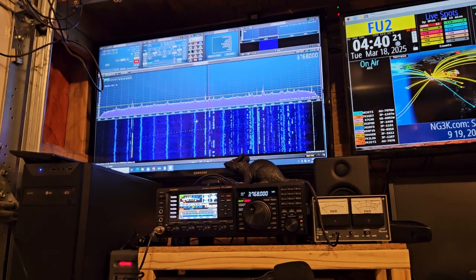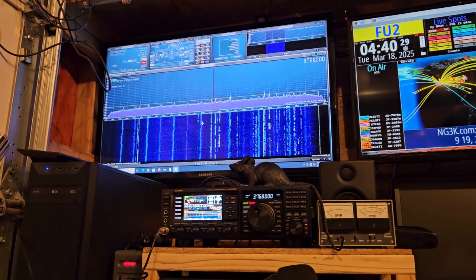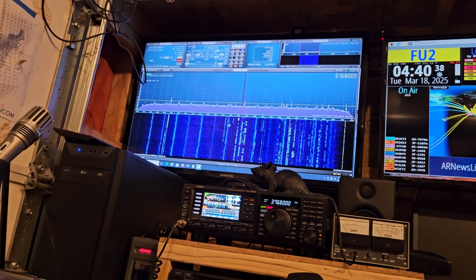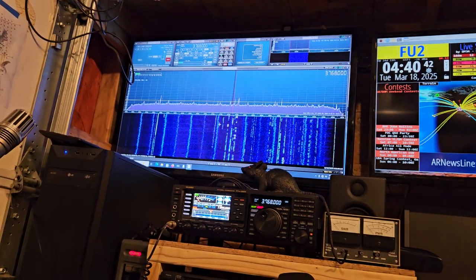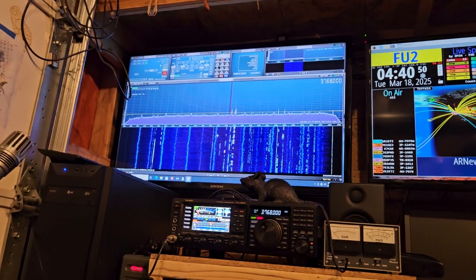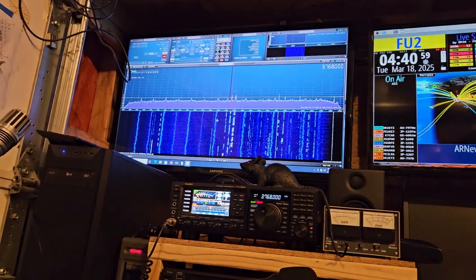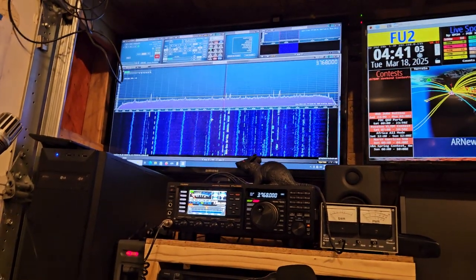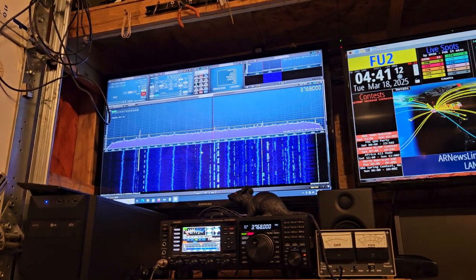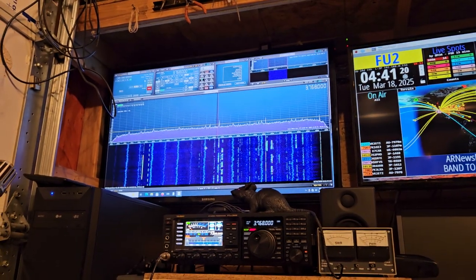What it doesn't like is if you shut the radio off while SDR Uno is still running, because once the radio is shut off you can't actually receive much of anything. The signal comes from the radio's antenna and goes through the front end of the radio, then through the bandpass filter unit — the input version. On receive, there's a group of filters whose job is to narrow things down. For example, if you're on 10 meters and you tune SDR Uno to 80 meters, you'll hardly hear anything because the bandpass filter is attenuating all frequencies below the 10 meter band.